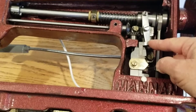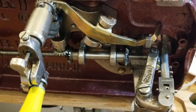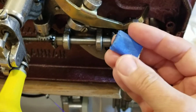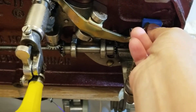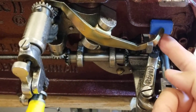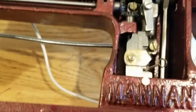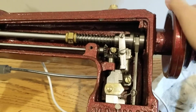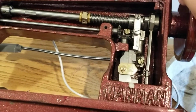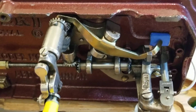But I want to show you first how to temporarily disengage the stop-motion. If you go to the bottom of the machine and you see when you pull it, it's like this. The way to temporarily disengage it is you just get a little wad of cardboard. I have here a wad of cardboard with a piece of tape around it, and you just shove it under this thing. So now that's wedged in there. It has pushed this lever down, so this piece that comes down from above is now pushed down, and I have temporarily disengaged the stop-motion. If I rotate the hand wheel, you can see that this piece from below does not come up. I have now disengaged my stop-motion. That's just temporary — just super easy. Just shove a piece of cardboard under there. Easy peasy.